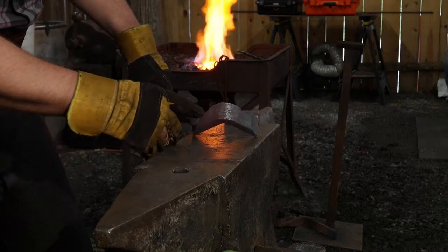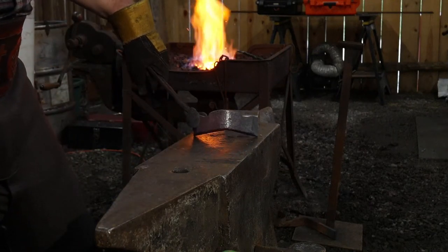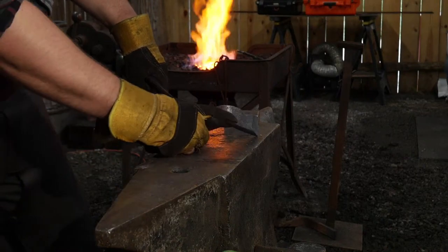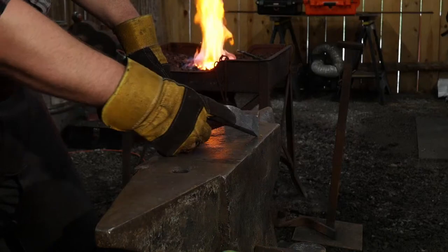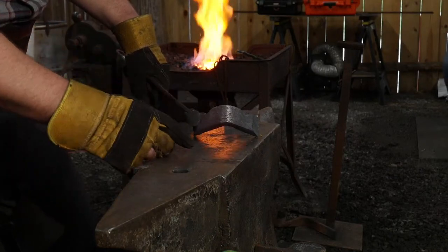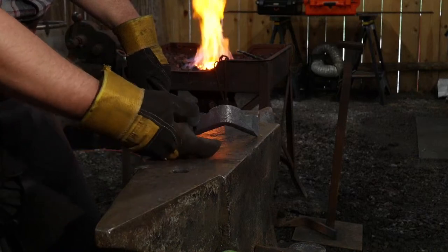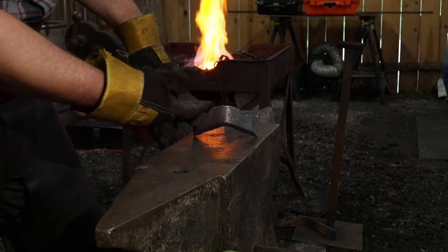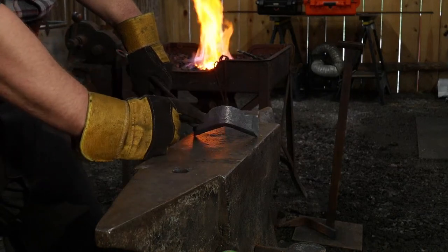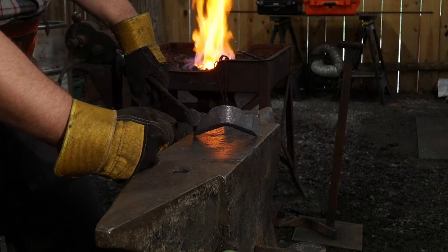And I don't know if they can see that. Can they see that from that distance? Can you see that crack there? Vaguely. So this is not a crack. This is a delamination, a delamination between the grains of the actual iron. That's where too much silica or silicate has worked its way out. Sometimes I've even found rocks, literal rocks, inside bars of wrought iron.